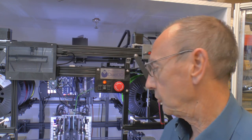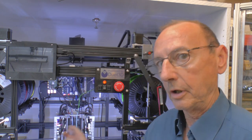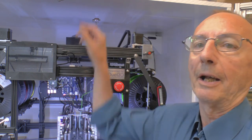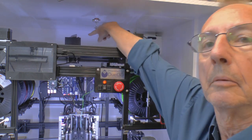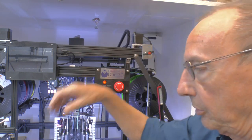I've got something interesting going on behind me here, for people that follow me on my blog or YouTube channel. You'll know that this is a CoreXYUVAB, and basically what that means is the extruder gantry, this lump here, is on a separate gantry. It's a UV axis. And then I've got a load balancing gantry, which is that thing there, which has just got lumps of lead in it, and it does the opposite of whatever the extruder gantry does,